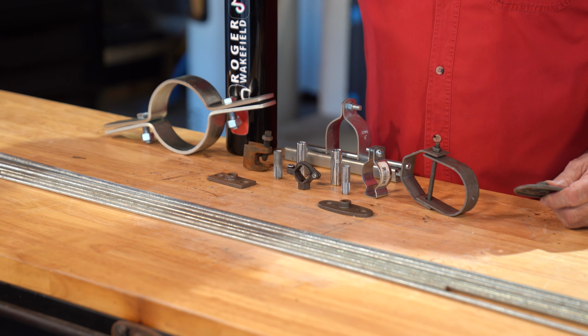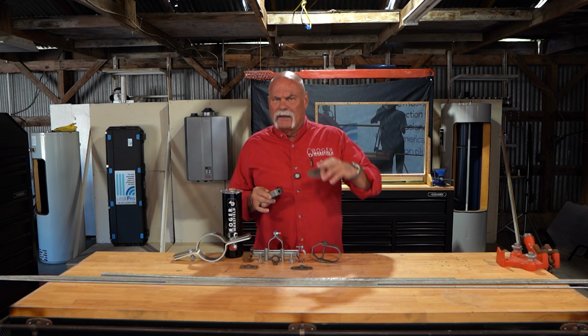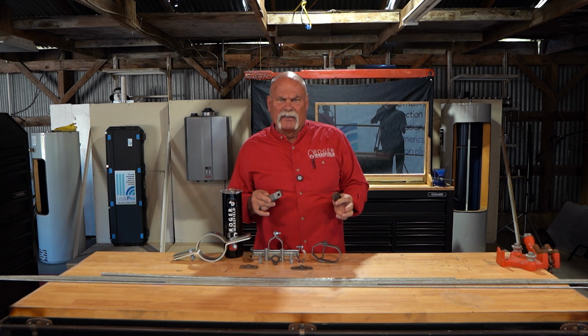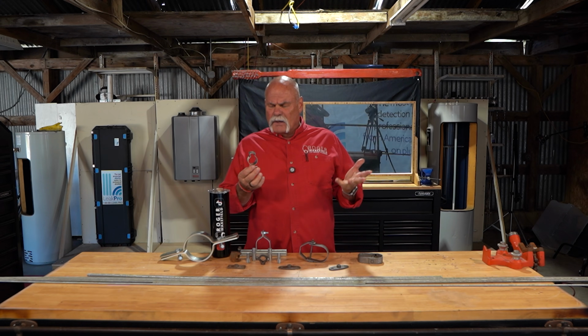But make sure that when you're looking at your drawings or you're talking to your boss, you ask them, hey, BOP, is that inside flow line? Is that bottom of pipe? Or is that bottom of insulation? And make sure that everybody's on the same page. So let's jump in here and figure this out, and let's do it now. So let's start out here.